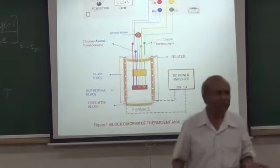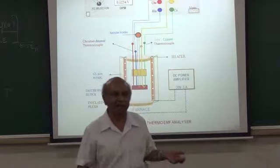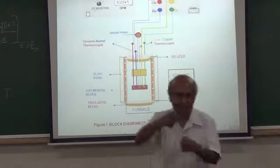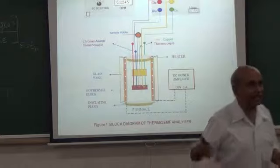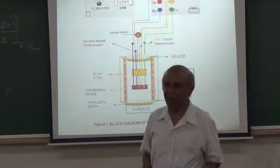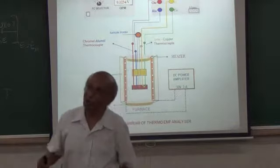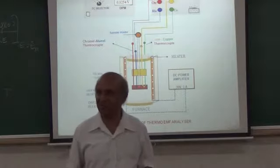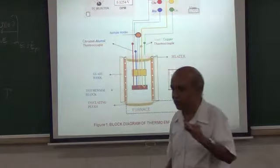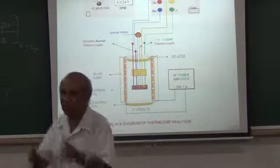But that is all. We are using Joule's law only. Resistance is high, I squared R, we pass the current, we convert the electricity into heat. It is very easy, not very difficult. So I wind a heating coil, and the system in which I have made it is meant for safety, because I know students use it and I also know teachers use it. So we should not use 230 volts operation. It is meant for lower voltages. So even if you touch it, nothing happens, because I operate it with just about 20 to 25 volts. We use higher current and lower voltage. Totally about 100 watts. I put about 100 watts into this.